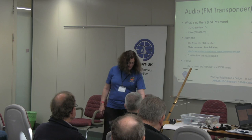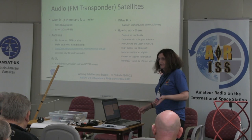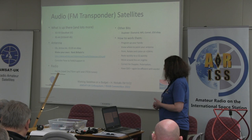I started in the morning, made the antenna, followed some AMSAT recommendations about how to program it, and that afternoon I got it tuned up. I've got a VNA so I checked it — pretty good from the start, a little bit weak on 70cm, pretty much 1.1:1 SWR on 2m. I listened to some satellites, and the next day I worked my first satellite and got 5 and 9 both ways. So it can be done, and it can be done quite easily.